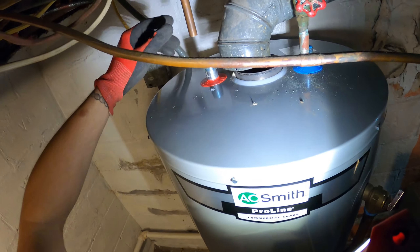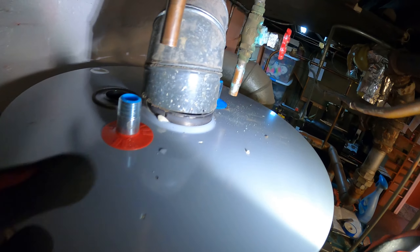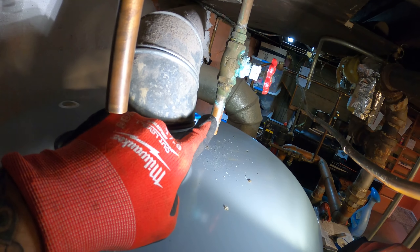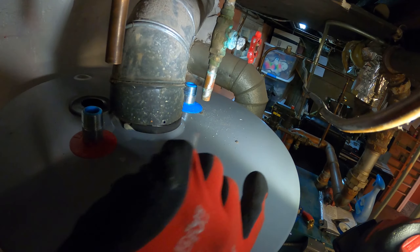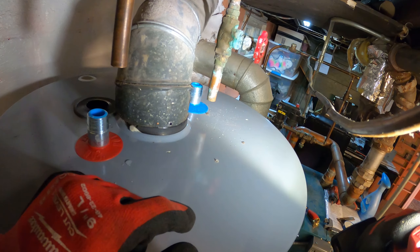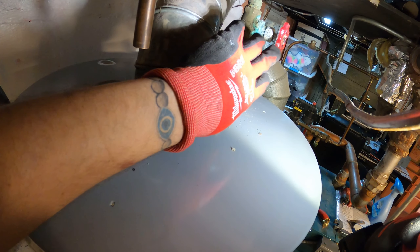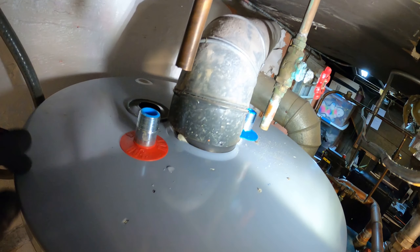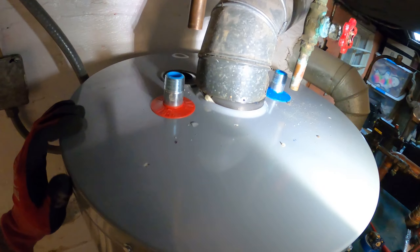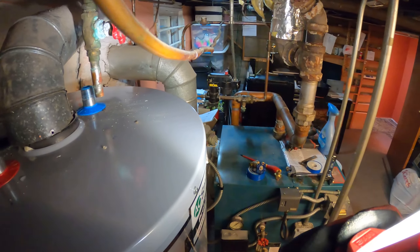Let me cut this back a little bit and now I've got to rearrange these water lines. We are going to replace this valve – this thing looks absolutely terrible. In order to do that, I have to drain the main of the house. So I'm going to close the main water valve, drain it, and cut this back. I plan to cut from here to here and redo the elbows coming in. Let's close those valves.